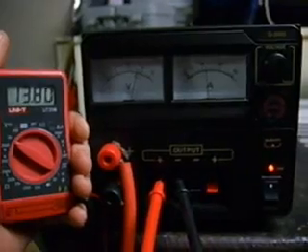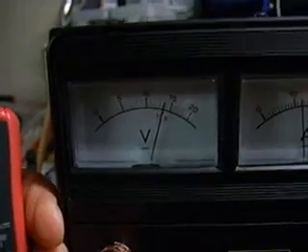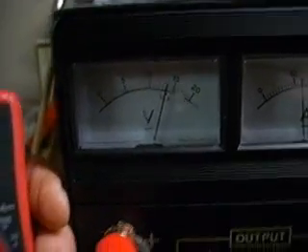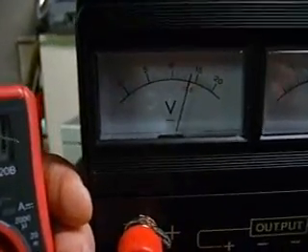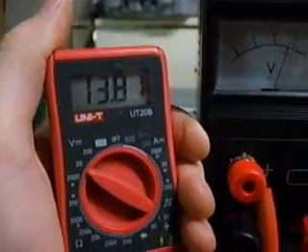Right now I'm just checking to see if the voltage showing on its display is exactly what I'm putting out. I've got it set right on a red dot that says 13.8 volts, and that's what I'm getting out of it with my voltmeter — 13.81 volts.